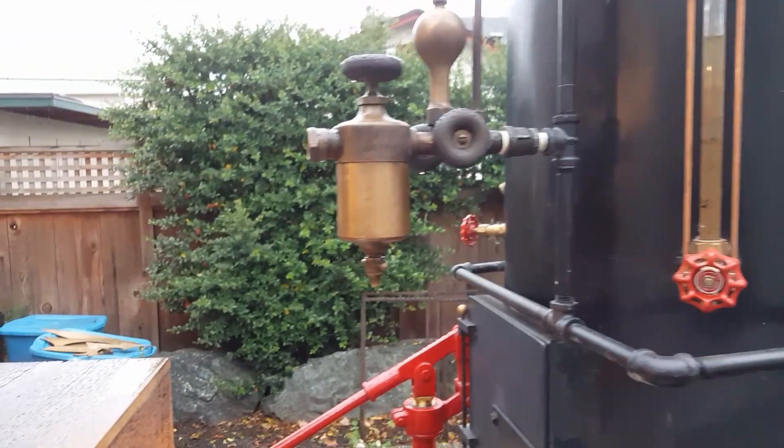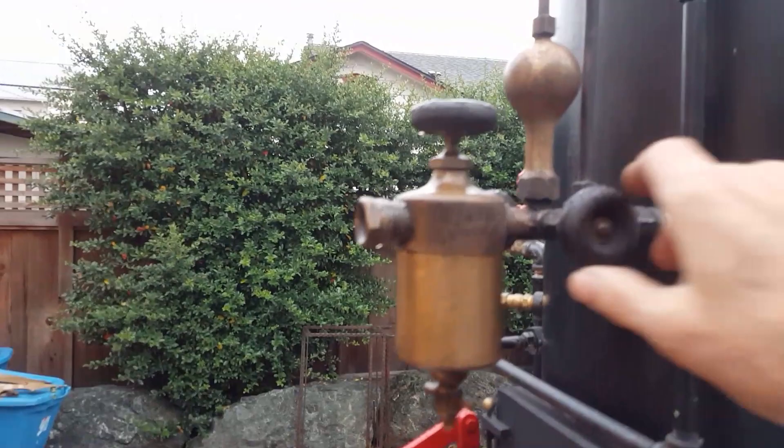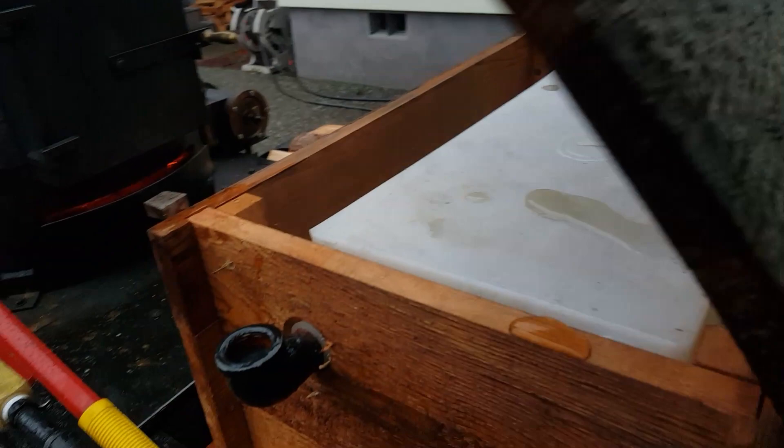A couple features: always keep your water — I always put it about a little above halfway on your boiler sight glass. You will need steam oil for the oiler. I'll ship it full. These knobs I just turn maybe a quarter turn open, one on each side. Back to this — your draft and ash pan.